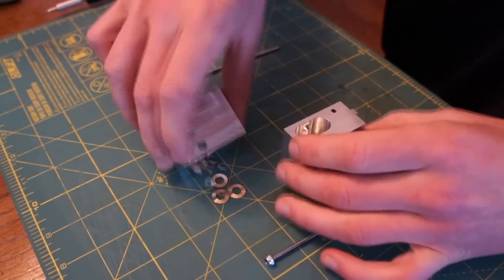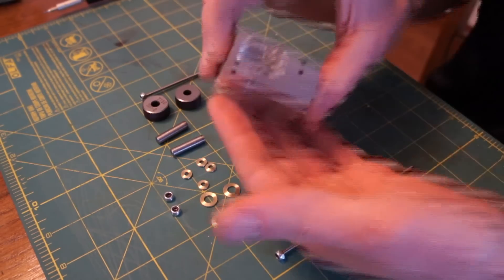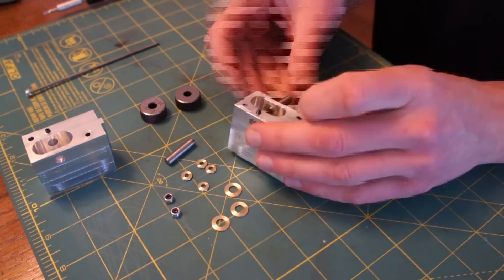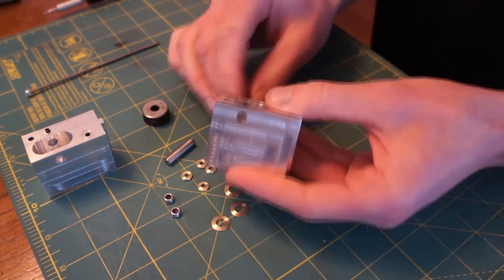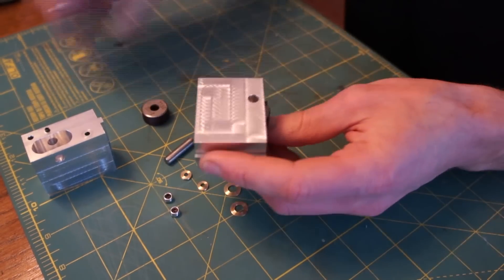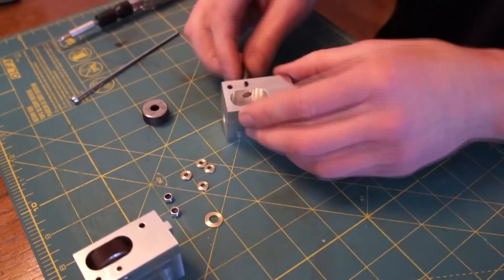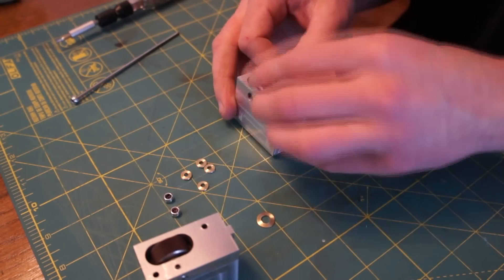With everything cleaned up, this is the final assembly. You can see all the little washers I made, and I also made some small ones that go on the 10-24 screws that pull the two blocks together. Off camera I also turned up some pins — just some drill rod that you can see there. Here I'm trying to get all the washers and knurling wheels and everything lined up. Once in the correct position I just tighten that little grub screw and that keeps the axle in place, while giving enough room for the knurling wheel to move back and forth to help it index into the cut once we start cutting.